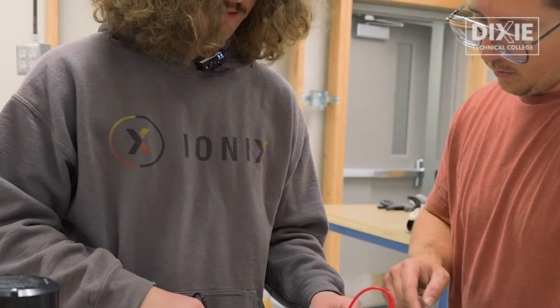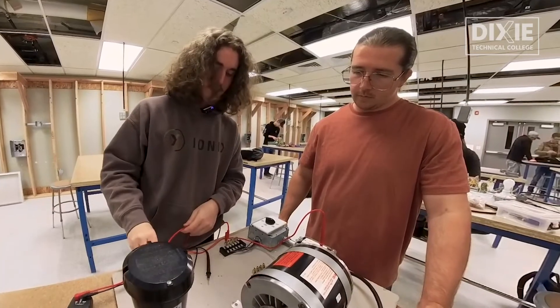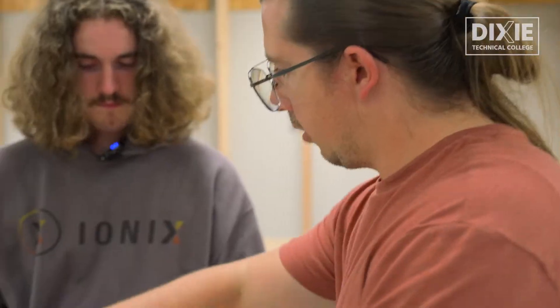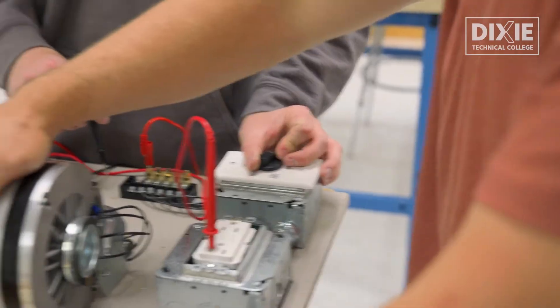So pump is this last one. You'll take a lead from here over to the pump. So from here I go to the pump. So now, when you do the high cool, it's going to turn both of these on. So what we want is to go the other way — go to low — because that's going to be the low setting on the motor.